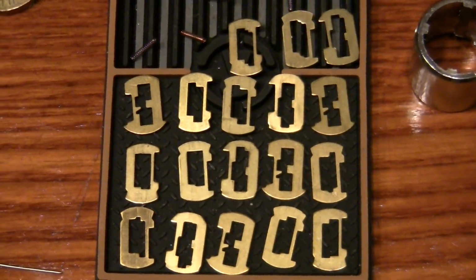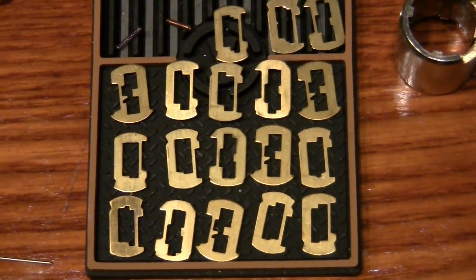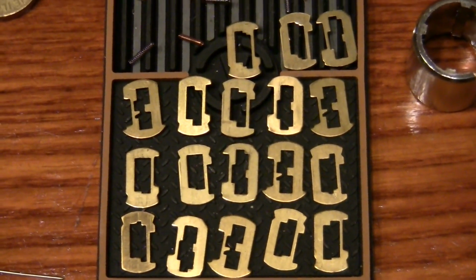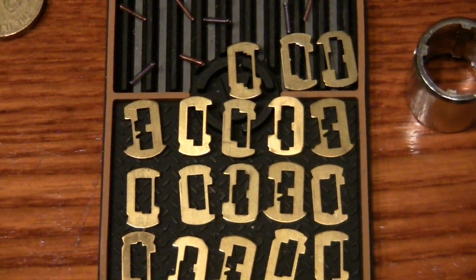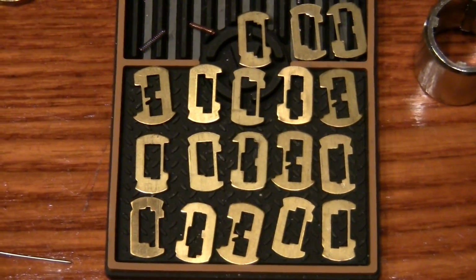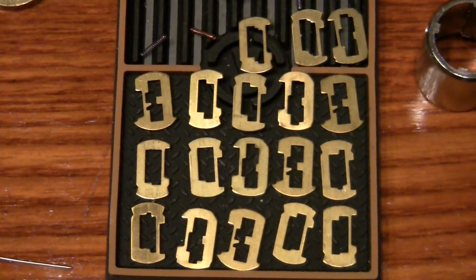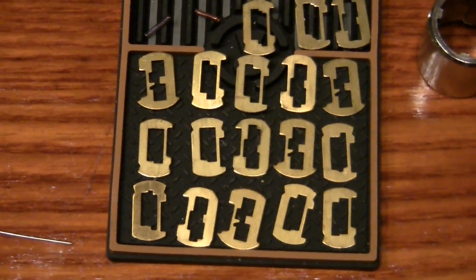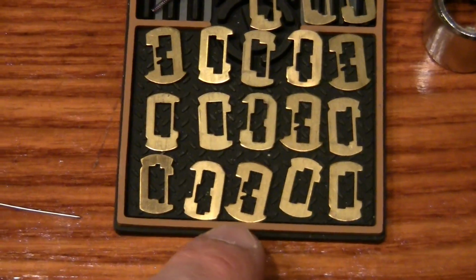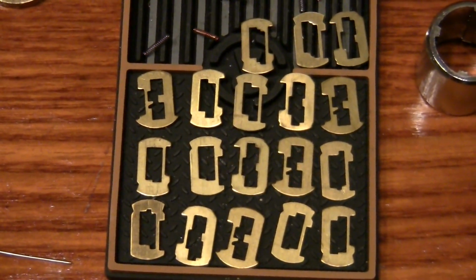So that's the Illinois Duo in all its glory. As you can see, there are several types of wafers depending on which part of the bitting the wafer is going to interact with. It also seems that some wafers are, let's say, passive. I would say these are those with the more round tops, and they are wider. These, I guess, go into those deeper cuts on the top side of the core.